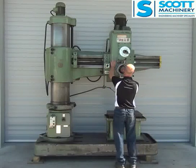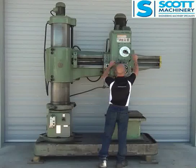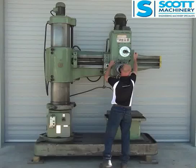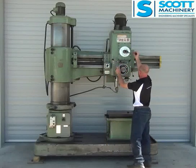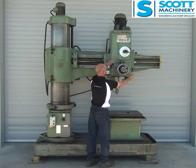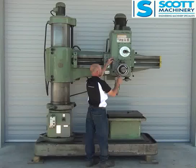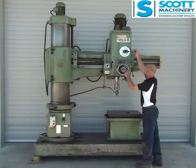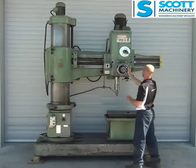We'll get the feeds going. There's the feed there - I'll engage that. Come around and get through some different feed speeds. That's the slide. All it needs is a wee bracket making up so it just trips it out, but it is tripping out nicely and engaging nicely. All your speeds there on that feed - feeds working well, forward and reverse.